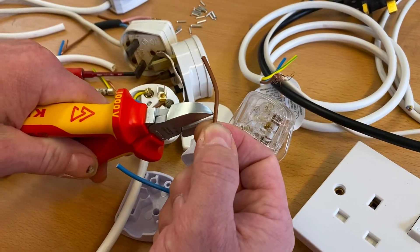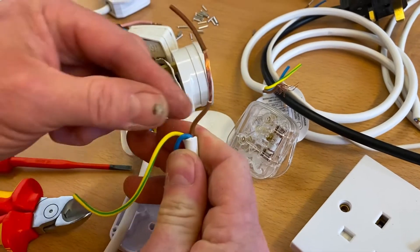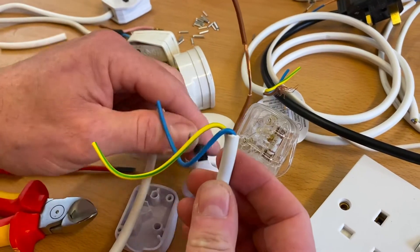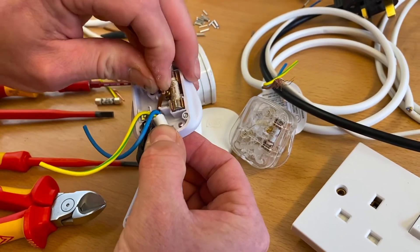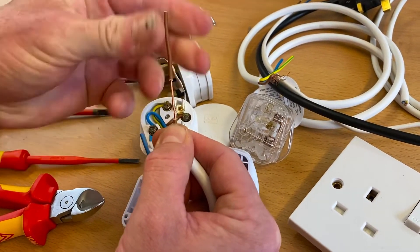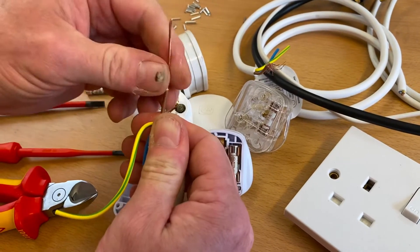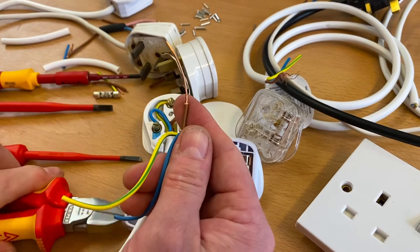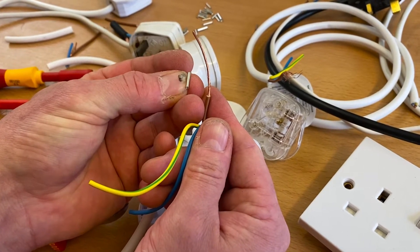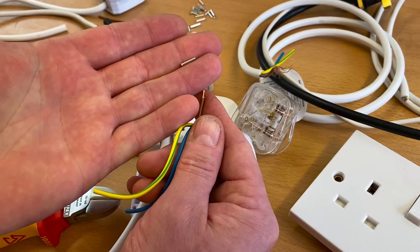I'm going to make a little mark at the appropriate length and bring in my side cutters. I recommend practicing with a piece of flex before going into your plug top. The tendency with a small piece of flex is to pull it longer than you had before, so it's worth checking when you lay it back it's the right length. We can twist it tight leaving the PVC on - we don't want to lose any fine strands. It's a class 5 fine stranded copper conductor which gives it great flexibility.